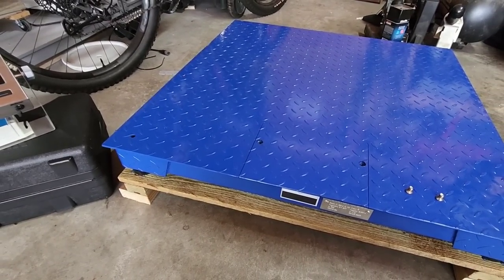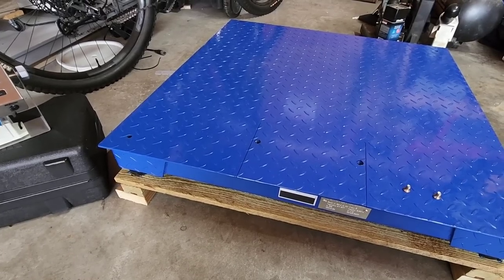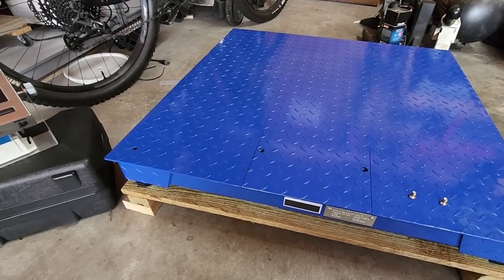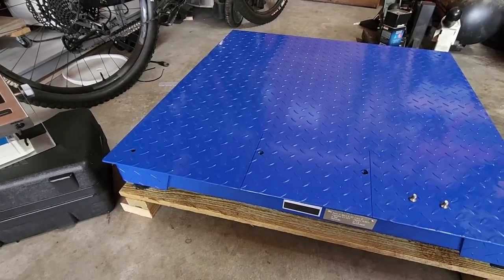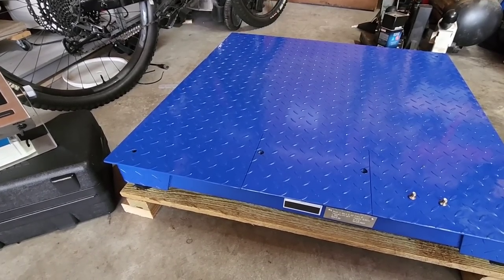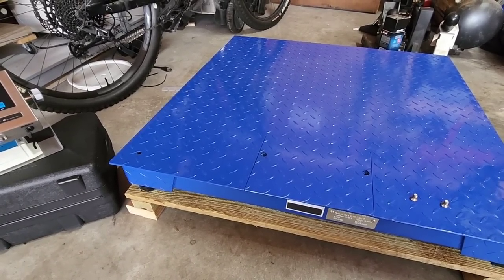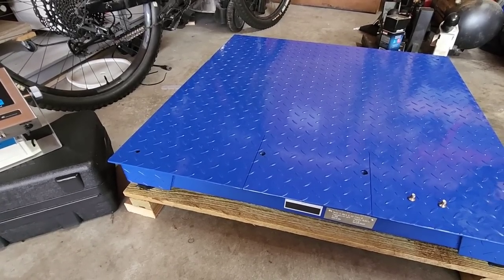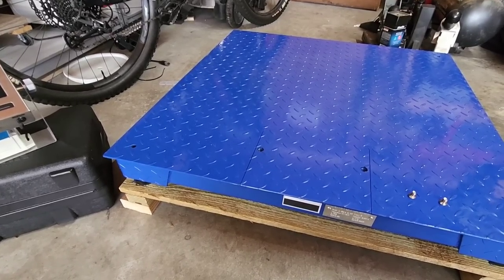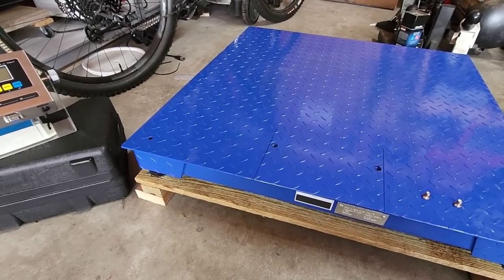The scale itself is the SL800, a three-foot by three-foot scale. It's NTEP certified, which is a certification needed for the transportation industry. This is a floor scale offered in five different capacities. The one in front of us is the 10,000-pound rated scale with two-pound accuracy. They also have a 20,000-pound version with five-pound accuracy, a 5,000-pound with one-pound accuracy, a 2,500-pound with half-pound accuracy, and a 1,000-pound scale with 0.2-pound accuracy — probably more accurate than your house floor scale.